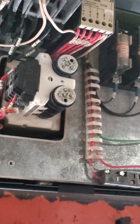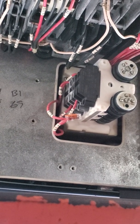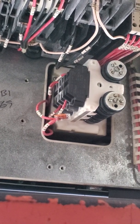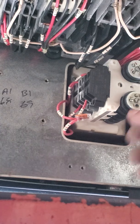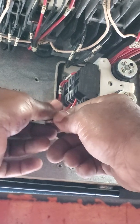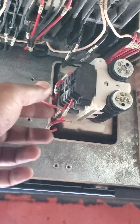But right now we're working on this little one right here. It's already adjusted for where they want it in the down position, so the only thing we had to do today is change that one switch out instead of changing the whole limit switch. Let's get out of that habit of changing the whole limit switch — change what needs to be changed only. This was the jumper here, just to test it to make sure it went up and down properly. And it was going up and down without any issues. Putting this jumper in here confirmed that the switch was going bad.